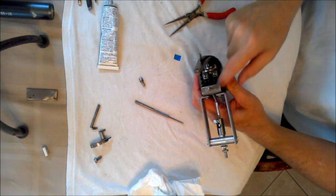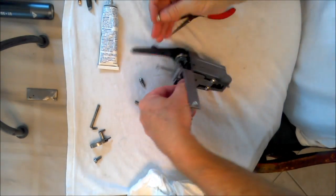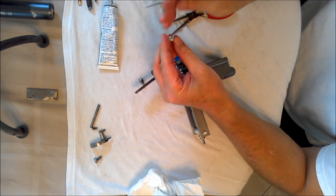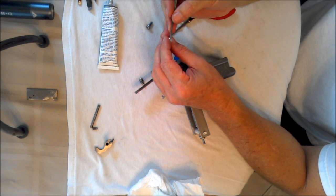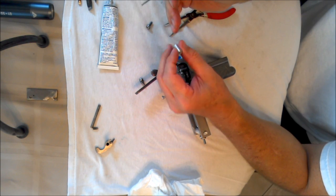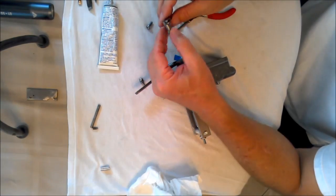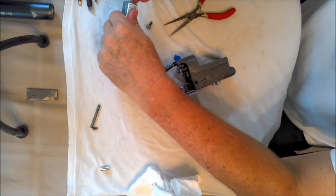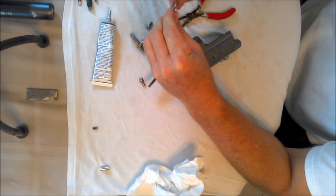I really don't need this in here at this time, but I'll just move that out of my way. Right, so first step, I turned a piece of aluminum, grooved. Originally, what I was trying to do here was with the original cap on this, once I compressed it, I grooved it out so that then I could remove this. But I was never able to find a way to keep that spring compressed to where then once I was ready to release the tension, to take the tension off the spring. I measured out the stirrup on this and my cap, and everything seemed to be measured correctly. So I don't know what they did at the factory and how they went about it. So I just redesigned the part.